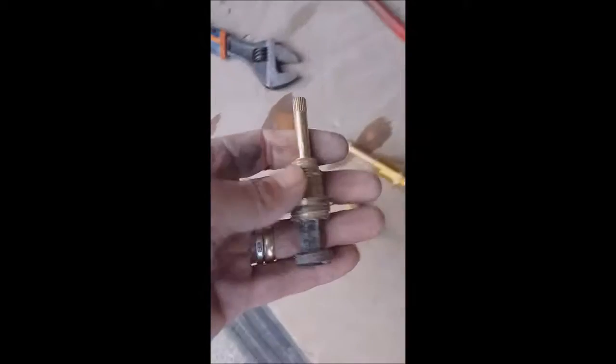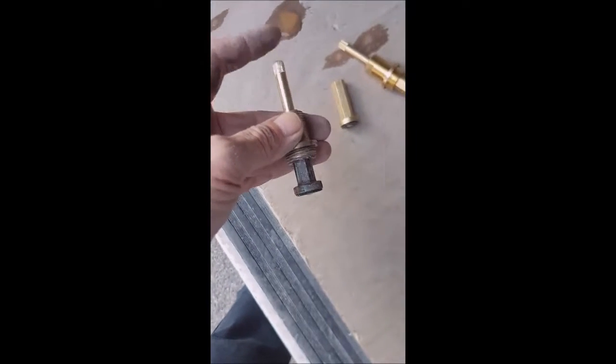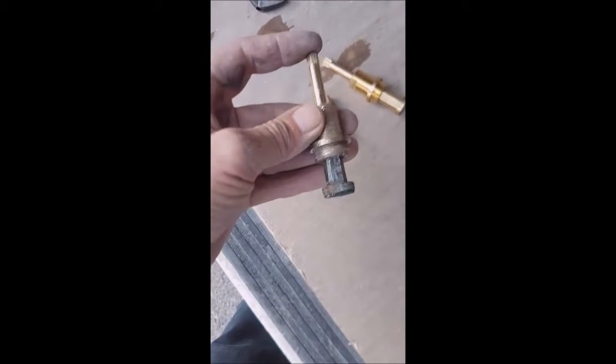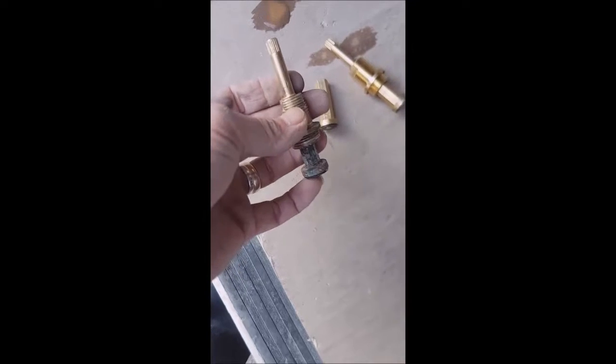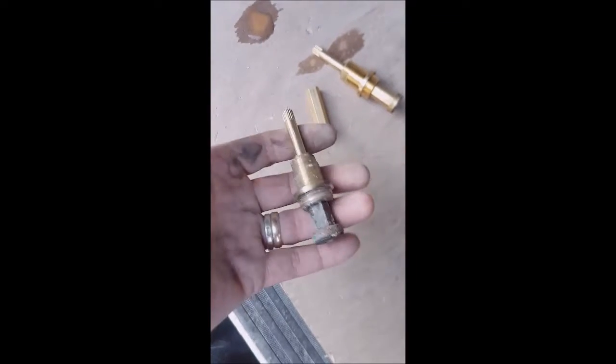So in this case of the worn stem and rubbers, I've taken another stem, I've measured it off already, they're the right ones, changed the bottom valve stop, all works lovely, replaced it, new circlips, new rubbers, we're back and running.